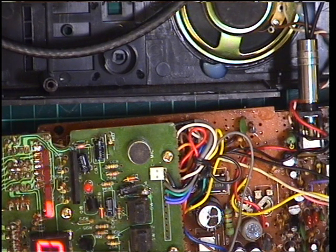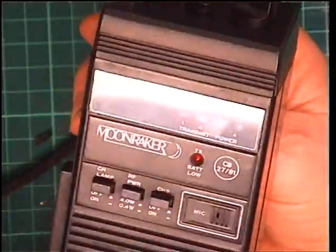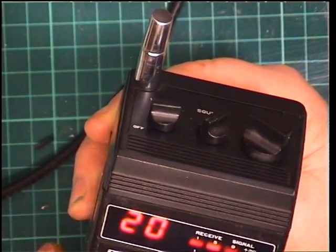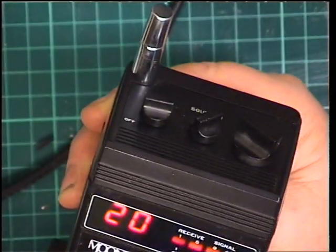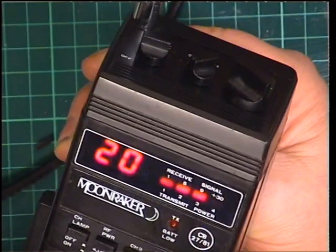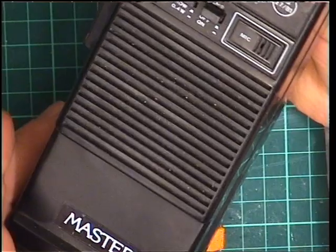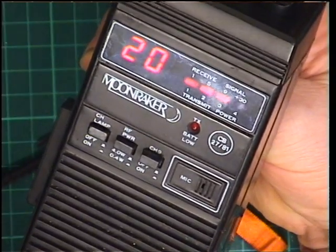I don't think there's anything else on the radio that I can tell you about, so I'll just put it back together. If I hold the power onto the battery clips now we've put it back together — you turn the display on and off, you've got the channel 9 switch, power high and low, and a quick flick of transmit with it on low power. And there we go. We'll probably do an on-the-air test — I'll get Mr. C when he comes at the weekend to take it six miles away and see whether we can get through. So there you go — the Moonraker Master hand portable from around 1983. In our range tests we actually got 14 miles on one of these. Thanks for watching.